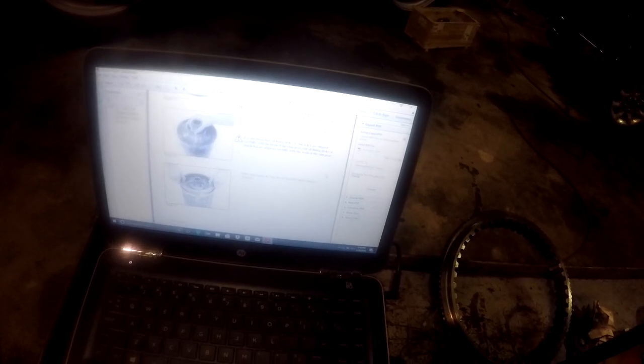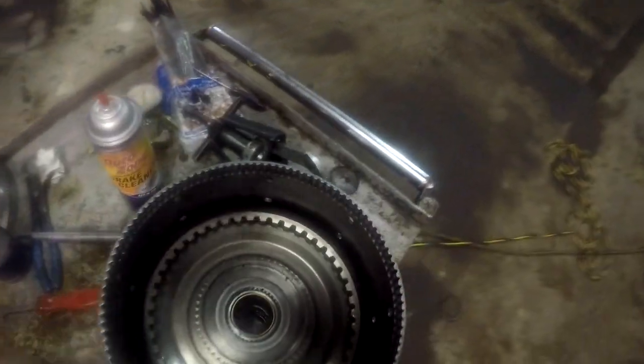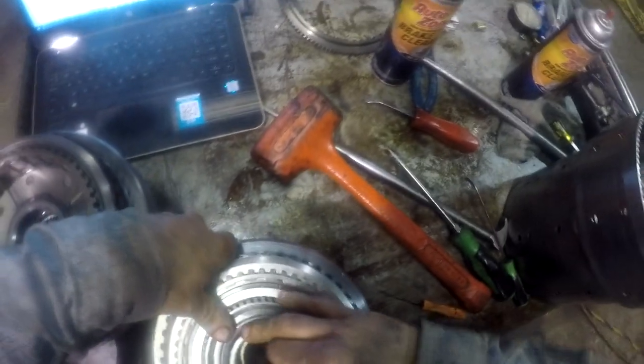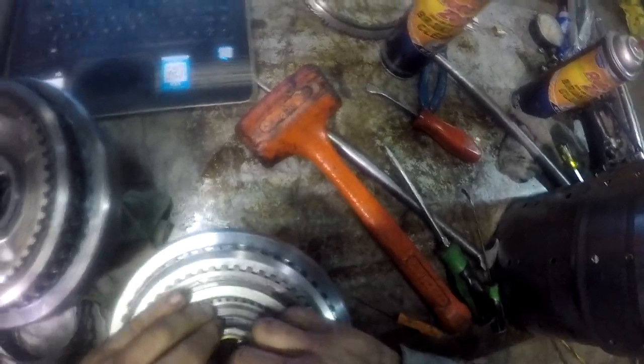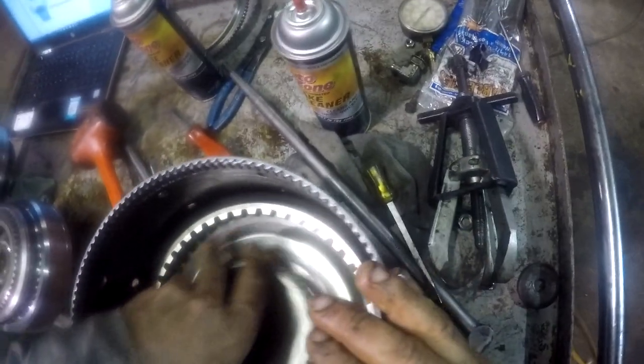Start the preassembled K1, K2 into the spline tube until contact is made. Okay, so now this is where we're going to spline all this stuff up. It'll be fun, huh? I think what I'm going to do is take this gear and try to line these up halfway. I got one that's not really wanting to. Those are all lined up. So now let's stick this one back in there and see if we can get her splined up.